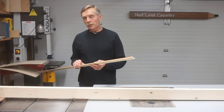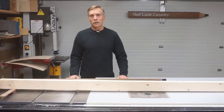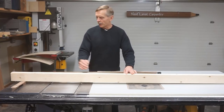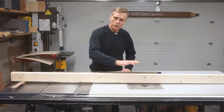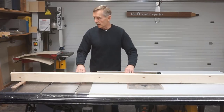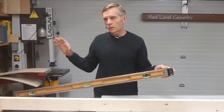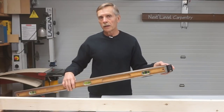Making super shims is actually a pretty straightforward process, but you do need a few things to get it done. The first thing you need is an accurate measurement of length and thickness for the shim. I'm going to use this 2x4 as an example of a floor joist that's out of level and needs to be shimmed level before plywood's put down. A great way to get a measurement like that is using a level with a how-far-out gauge attached.